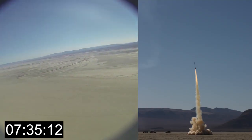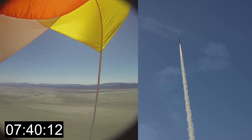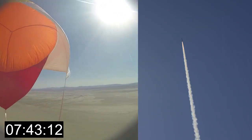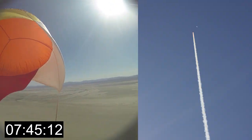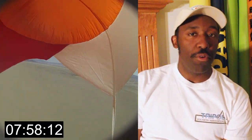I used a Tac-9C parachute for the main event parachute, which I set for 3,500 feet so we could visually spot it. I used a method of putting the parachute under a vacuum bag to suck all the air out so I could get it to fit in the tube, because it was very hard to fit. That worked successfully — I was able to pack it down very small, and as you saw, the parachute opened right up. I used 1-inch tubular nylon and 9/16-inch tubular Kevlar — a combination of both for drogue and main — the Kevlar to take the heat and the nylon for elasticity.